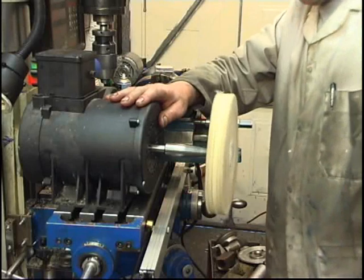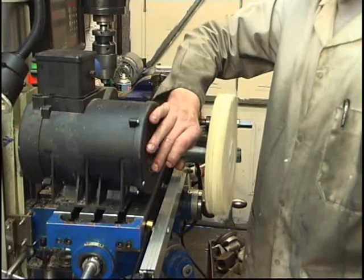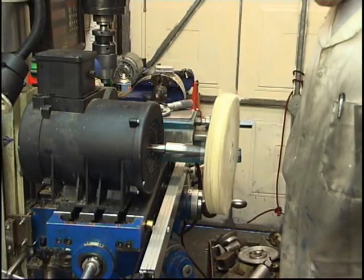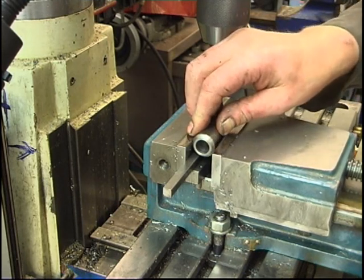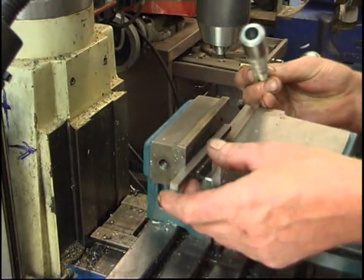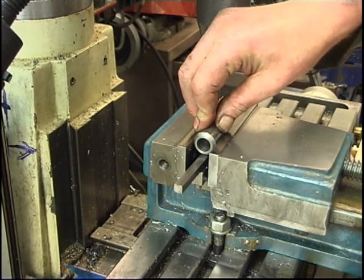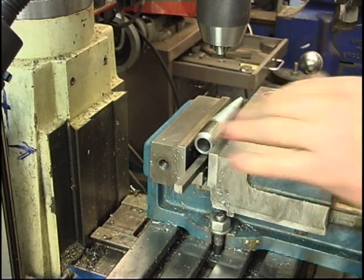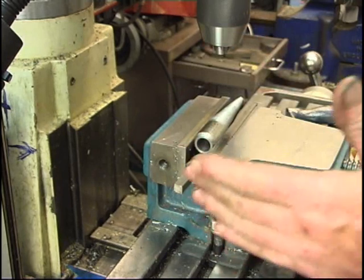Something of a health and safety issue for them really in there. Anyway, it's going in the right direction - the lathe runs that way so it's going to tighten itself on. Job's a good one. Open it into the vise - cut the back in a bit so it's a nice height to work at. The vise has got it above centre. Nip it up. It's not tricky what I'm doing - if it was I would use a v-block.